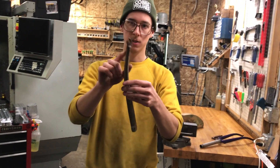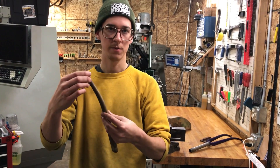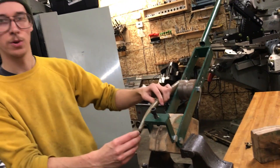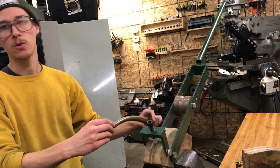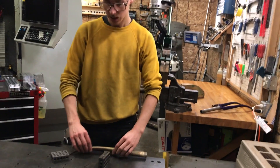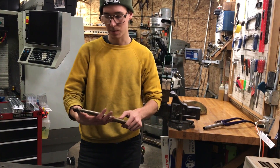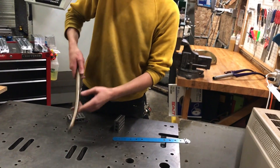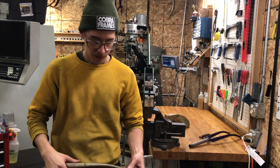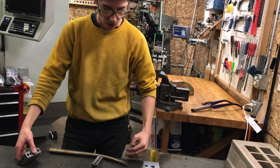If you have one of these dropouts that's a socket style, you can get it so it has good fit up on the end of the tube — cut the tube at the right spot in the taper and get that prepped. When you go to bend it, put it in, put a sharpie mark where it's going to meet some reference so you can put it back in the same spot every time. Do a bend to where you think you need, take it out, put it on here, measure how much rake — how much forward offset you have. If it's too much, you can bend it back. When you bend it one way, it's a lot more willing to bend back a little than to bend further. So bend it back if you have to — you don't want to overshoot your bends. That's how I measure it: setting it up and measuring the offset to an edge like this.